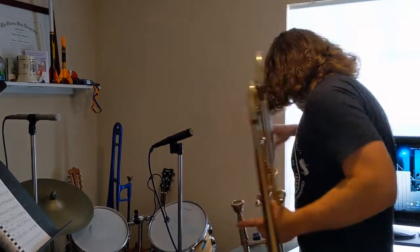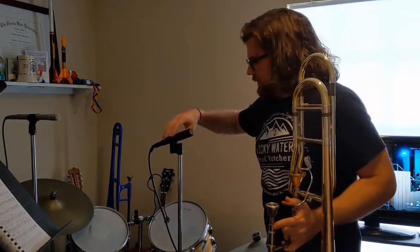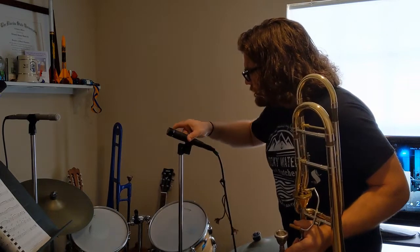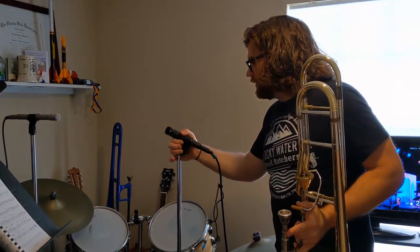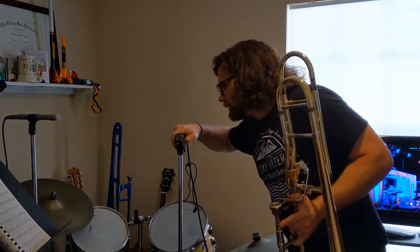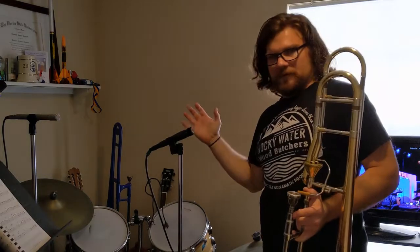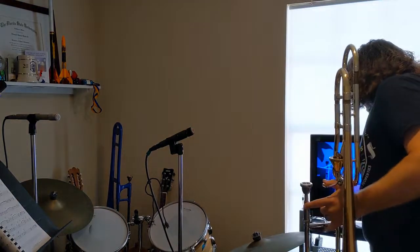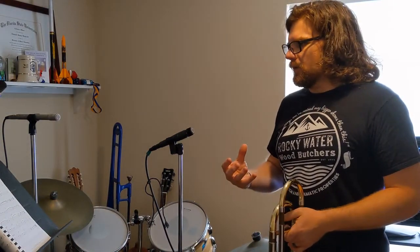You should hear a little bit of a difference there. I'm talking into just the SM57 now — the condenser is muted. If I'm talking and I turn it around, it should get softer. If I talk to the back of it, you shouldn't be able to hear it at all. If I talk to the side, you might be able to hear me. And as I turn it forward, you should be able to hear me clearer again. That's the positional consideration — where the mic is relative to the speaker.